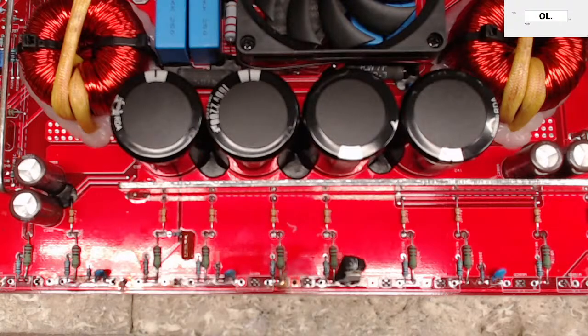You got to be able to see a clean signal when you're working on, especially Class AB amplifiers. You need to make sure your sine waves are clean. And if you have a dirty front end on your scope, you're not going to know if you have emitter follower problems. You're just not going to see it as well. So you need a clean signal. If you want to go cheap, I would just get an old analog Tektronix scope and start with that. At least then you have a phosphor screen that will give you a clean image.